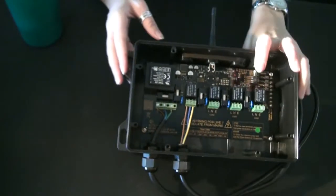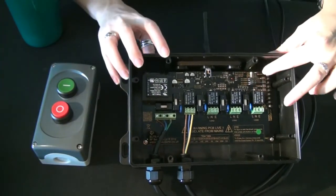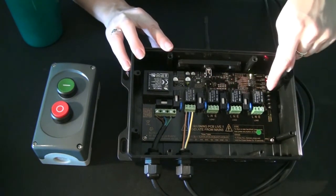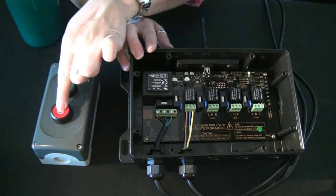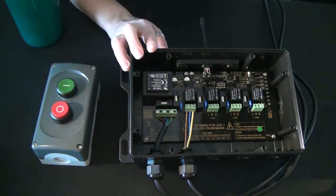Bringing back your Elite receiver board again along with your wired-in Bogey Board, like we did with the Squid Board, momentarily press the sync button and all of the LEDs will flash. Momentarily press it again and Relay 1 will continue to flash. During this time, continually press the button of your transmitter you wish to pair, and you'll see that it pairs to the light.